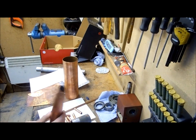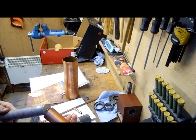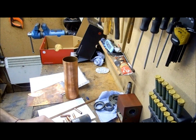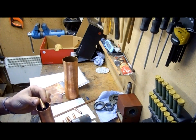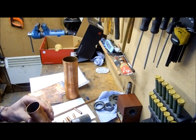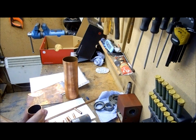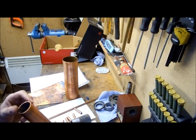Right away, I'm going to start with this. I've found a piece of aluminium bar which fits pretty good. I will use this when I drill the holes, because I know what's going to happen — the drill bit is going to snag and bite. I don't want to ruin this piece of copper. It's 35mm in diameter and its wall thickness is 1.2mm.